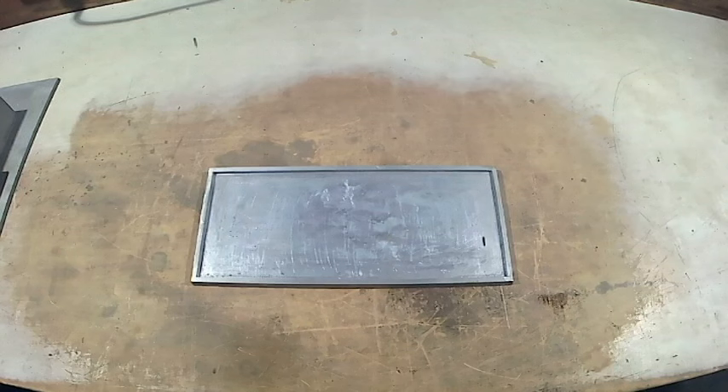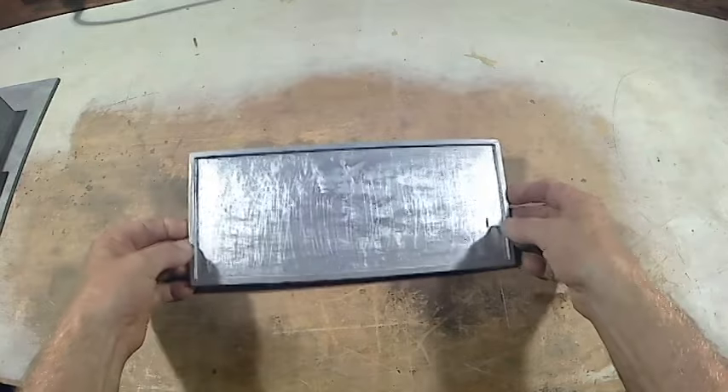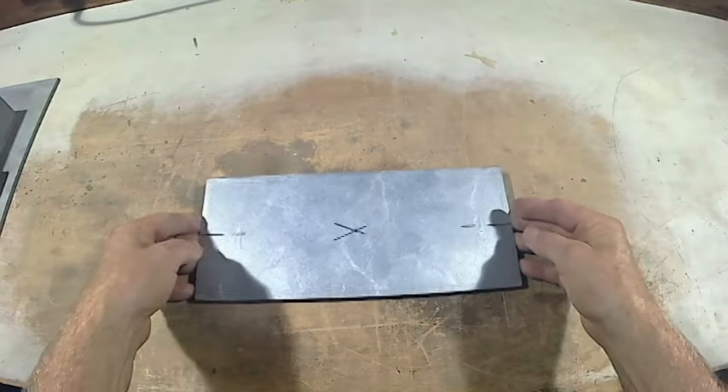What I'm going to do now is use another pattern and recreate this defect. What I suspect is happening is the sand may be too wet. I'm going to use an ultra dry green sand so it doesn't lift up the metal, and we'll see what happens.